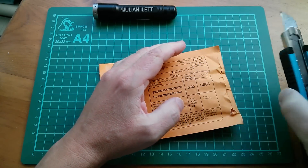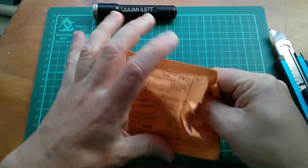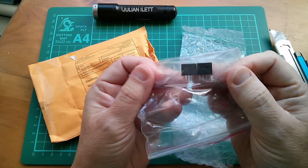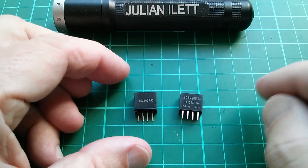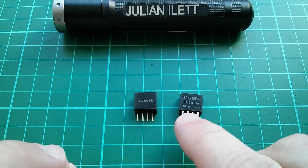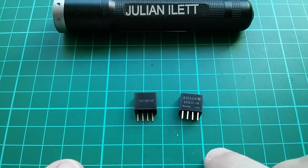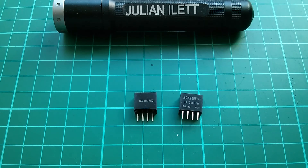Big knife, which is also blunt because I threw away those nasty plastic green ones. What have we got? It's two of these little DC to DC converters — MornSun B0505S. I'm pretty sure they are 5 volts in, 5 volts out, 1 watt. Now 1 watt at 5 volts is only 200 milliamps.